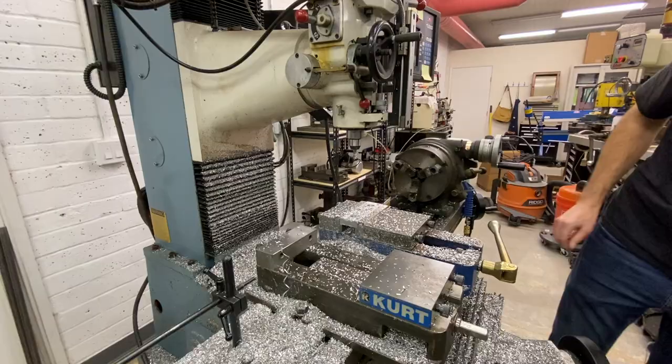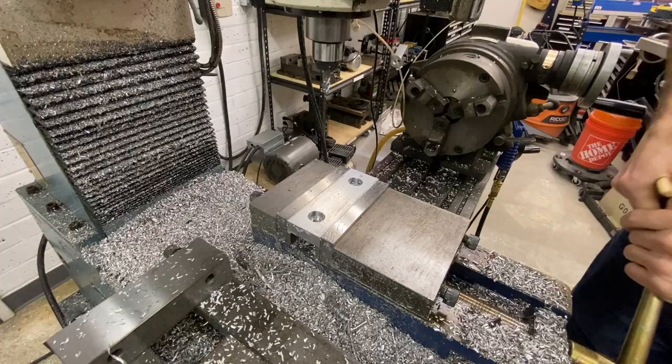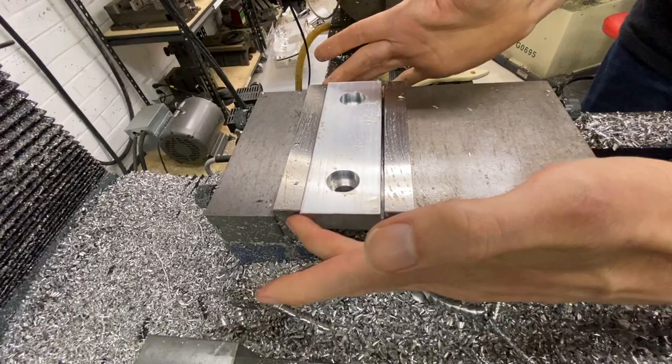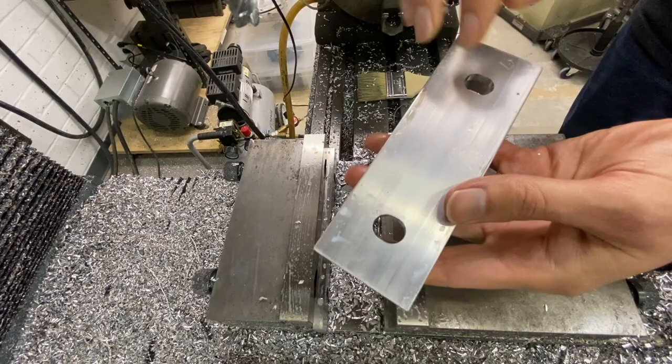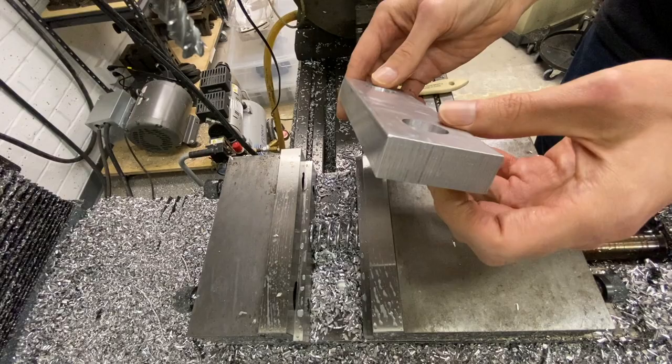It's a really good idea to have a program like this saved on your machine — it will allow you to make these whenever you need to. I didn't have any stop on the X; I just cut the jaws a little bit over six inches long because I like them to hang out a little, and then I just visually center it. These are just bandsaw-cut parts with the edges and corners deburred. I don't bother facing the ends — this is extruded bar stock and I don't face any of the faces at this stage. If I need to for the part we're going to clamp on, I'll do that as the job comes along. I don't recommend doing that work beforehand because it's time consuming and usually unnecessary.